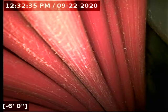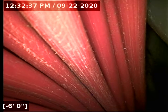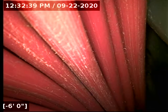Again, that's assuming you're just waiting for it to wear out, and a root intrusion or something doesn't find it first. Anyway, that whole main line is functioning properly at this time. And again, the belly from 18 to 25 feet is way too small, in my opinion, to recommend repairs on. But we're going to move the camera over to this backflow valve. I'm going to turn some water on in the newer, updated bathroom down in the basement and see if it routes its way through that.